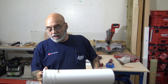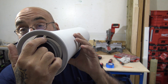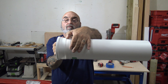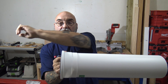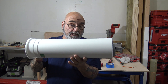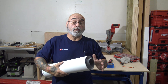When you're measuring this, if you look inside - it's very hard to see - there's a white hold-down holder piece. There's a stop, and that stop ends about right here. So you're measuring from here out. This is your engagement - it's the engagement for the white pipe, so when the white goes into a fitting or into a hub, it goes in this deep. The inner pipe, whether it's a poly or a metal, follows the same rule.